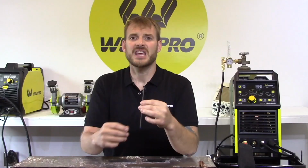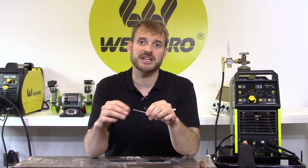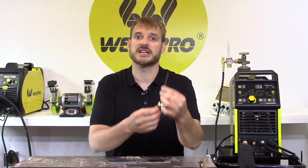the tungsten. If you have a very long point, under high current conditions, the tip of the tungsten can fall off due to erosion and land in your weld pool, causing contamination. The best way to achieve a perfect cone on this tungsten is to insert the tungsten into the chuck of a drill. Going slowly, you'll spin the drill as the tungsten is grinding. This will help achieve that perfect symmetrical taper that we're looking for.